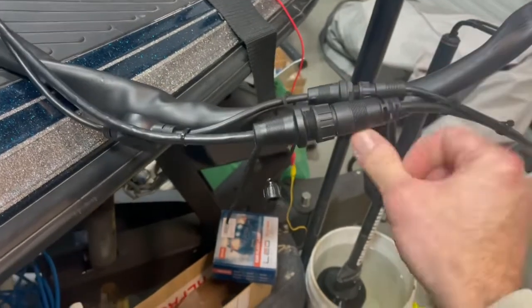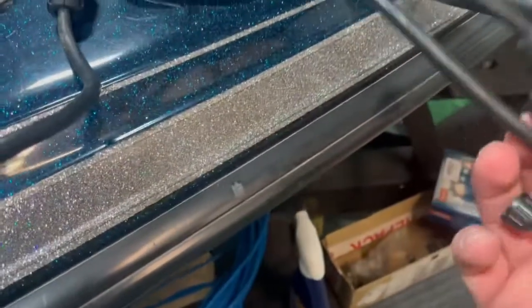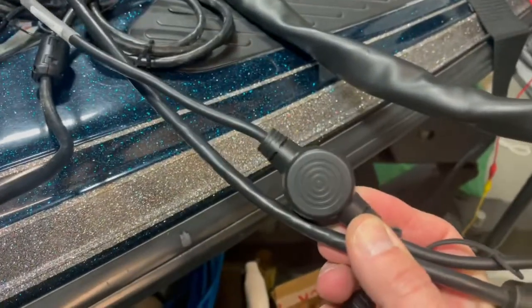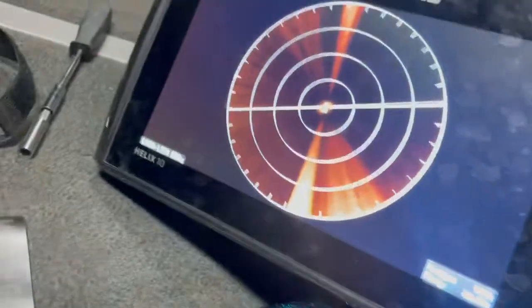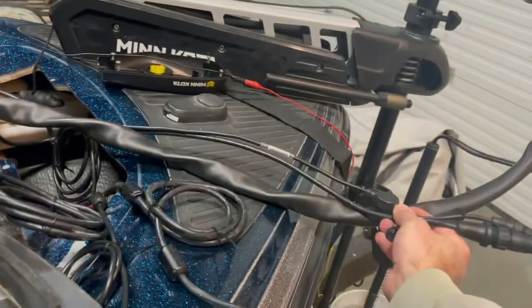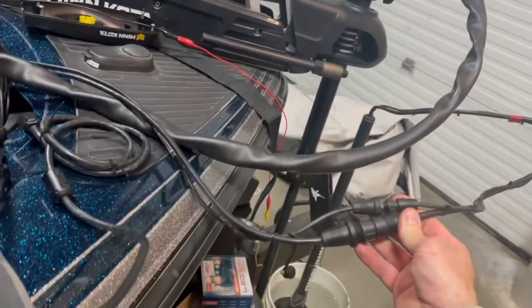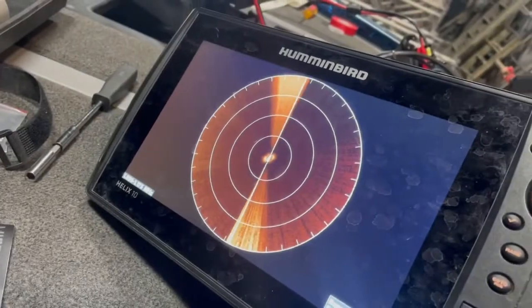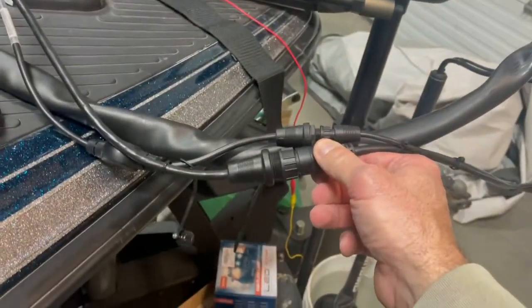This section is sensitive to coming close to the main cable here. There's a ferrite ring in here as far as I'm aware. It doesn't seem to matter whether that or any of these other wires are near it, but when this quick connect gets close, that's where I'm getting all my interference.